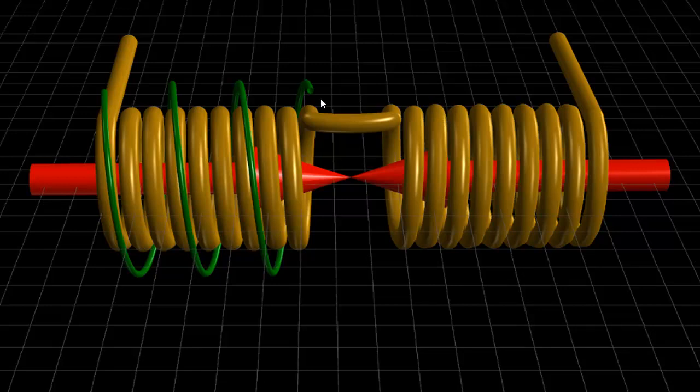Over here we have our third coil, asymmetry. The third coil sees the partnered output coil as its source, and because of the changing magnetic field in that coil, it produces a voltage on this coil. If this coil is loaded, it can carry a current, which this coil will then oppose. So we have three action sets: one, two, and then the third action set, where this particular coil has a magnetic field direction that actually assists your input coil.